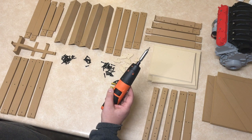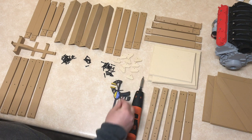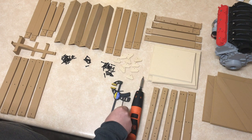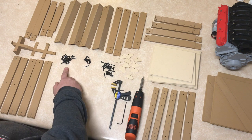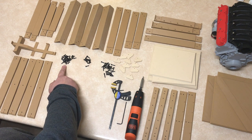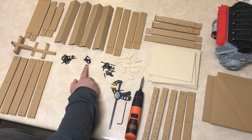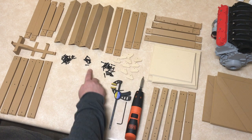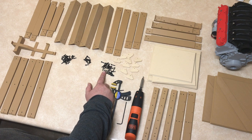Got a new electric screwdriver I just bought yesterday — we'll see how this works. If it runs out of power, go back to the trusty Allen wrench. I've got a clamp to help out putting these together. We've got a bunch of the 3mm by 10mm socket head screws for most of the sides and the top, a few 12mm ones to hold the side brackets, and a whole bunch of 16mm ones for the base. So let's start putting it together.